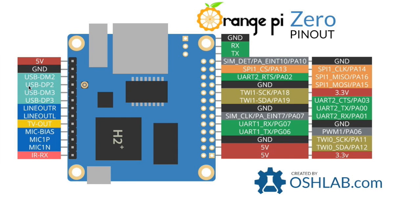So that's the block diagram of the board. I'm going to talk about the cons first, then the pros, then the philosophy of use. One cool thing is power over Ethernet — that gets you kind of excited — but then you read the spec and it's not standard power over Ethernet. To get it to work, you have to solder a bridge, or wire two pairs of pads together, to get power from the Ethernet. The board runs on USB, so that's five volts.